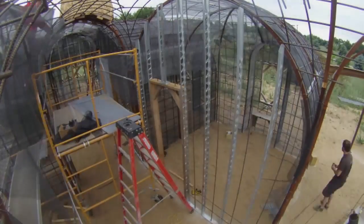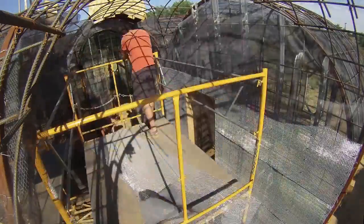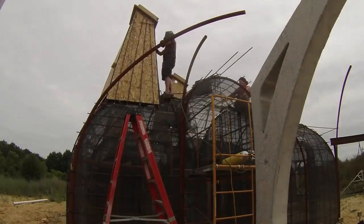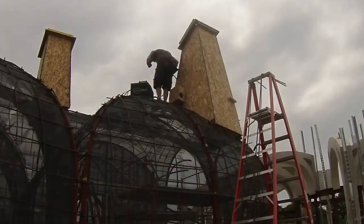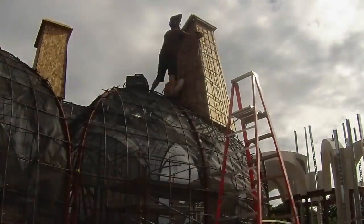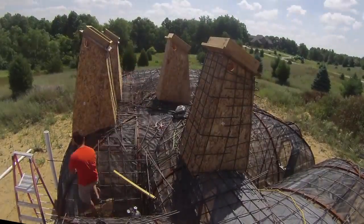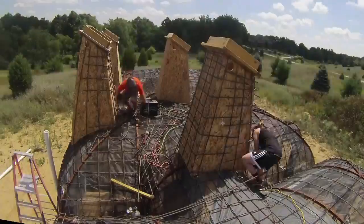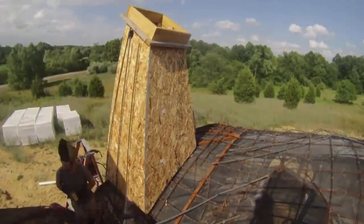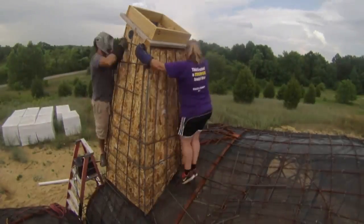Back to finishing that last interior wall. It was time to put rebar on the skylights to hold up all that concrete. We made lists of required rebar pieces with lengths and bend angles, then assembled one skylight at a time. I found it was faster and easier to tack weld these small pieces in place rather than tie them first — just hold them up and touch them with the welder. Bonnie came out and helped me crank through a bunch of them. Having her pass me pieces meant I could just climb into place, get the piece handed to me, tack it, get the next piece, tack it. Would have taken several times longer otherwise.